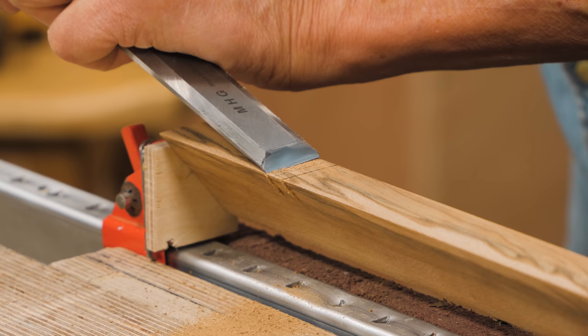Will I go with a wider chisel? I may well do. This is just guesstimating — am I leveled? Well, we do have that sense in us. I'm a little high on your side again, but not too much. I could actually leave it at that. I have the perfect groove now — I'm equal on both sides. The walls will help me because I am square. If I have a gap on one side and not the other, my baseline is not perfectly square. I have a slight gap — I'm going to correct that now using the chisel.